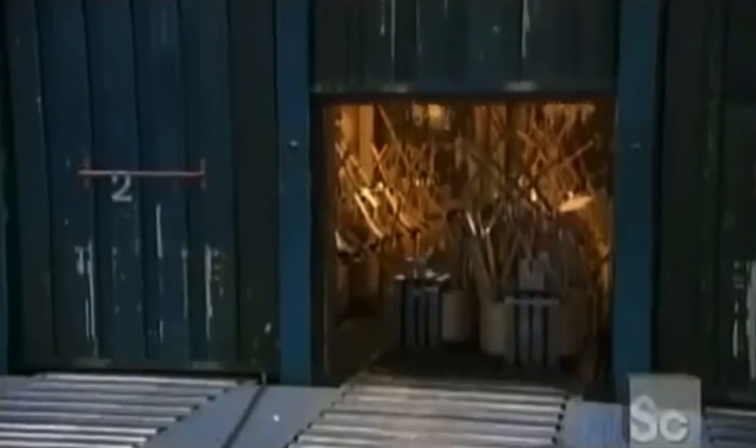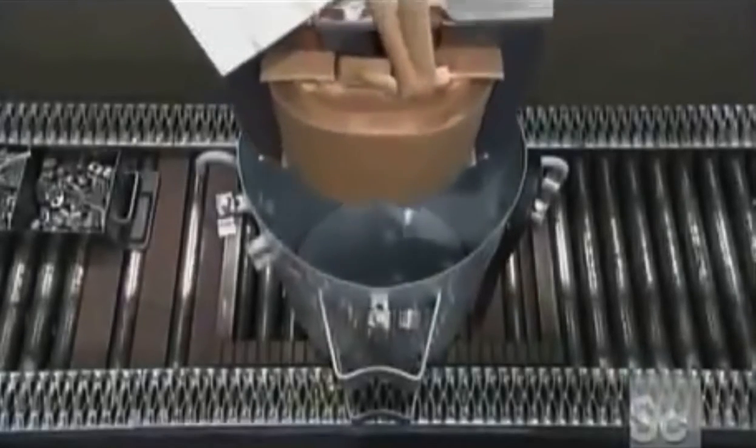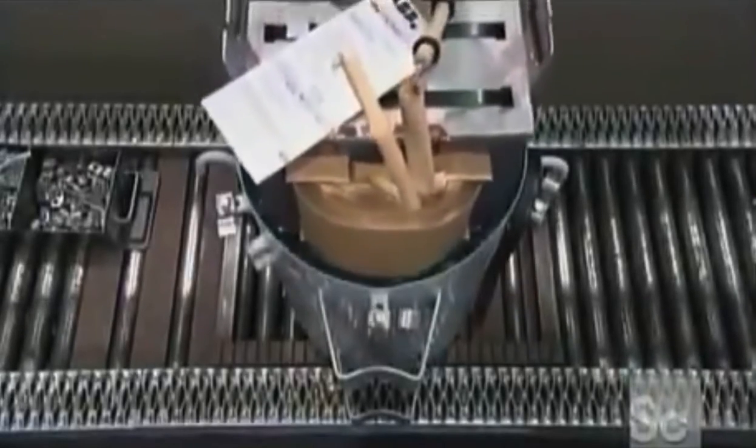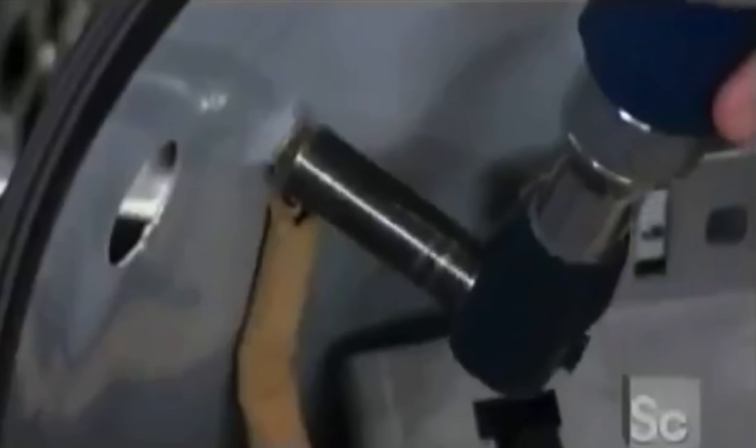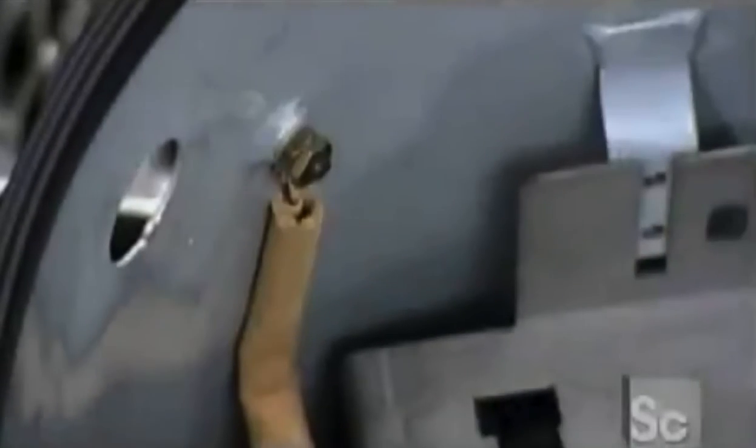The heat improves insulation by removing any traces of humidity. It also melts the epoxy glue, fusing together the paper, the aluminum strip, and the copper wires. The assembly now goes into a steel tank. A rubber gasket is hammered around the perimeter, and a grounding wire is bolted on.